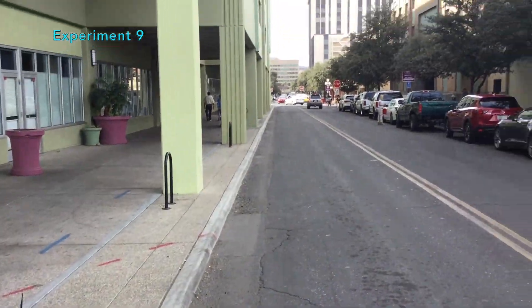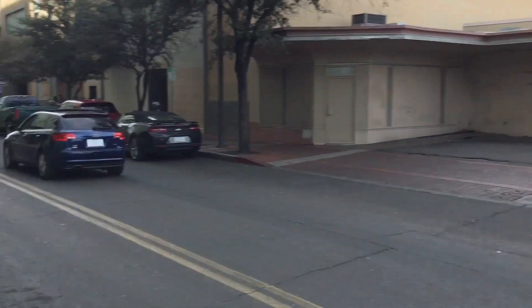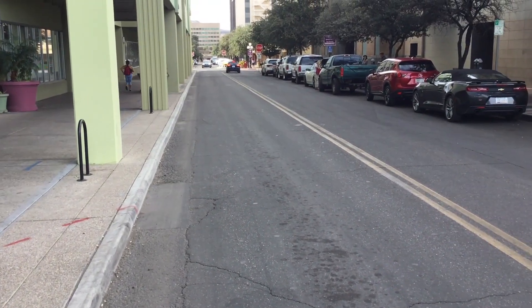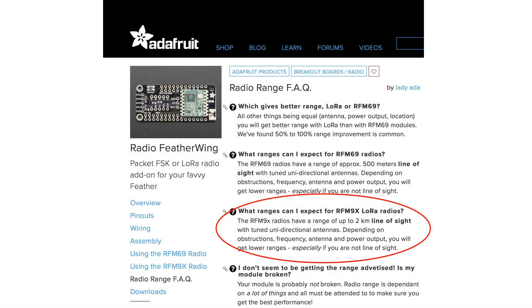This is my latest location — my building is right behind the Federal Building, which is that big brown block down the street. This is a different street with a different line of sight, and even bringing the receiver up into the street to try to improve line of sight, I can't get any signal or any response. The ranges I came up with in my experiments were significantly less than what I was initially hoping for based on the description of the hardware. However, I was not using a directional antenna, nor was I dealing with a clear line of sight, so I think the radios actually perform relatively well and the ranges can be improved with a little tweaking.